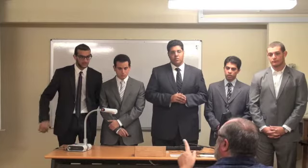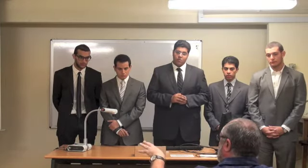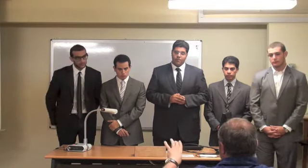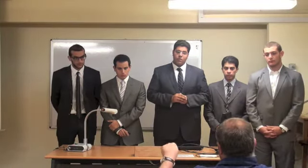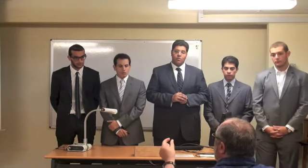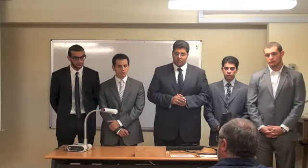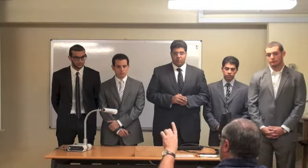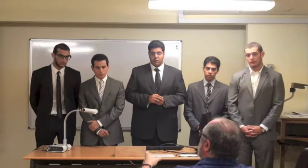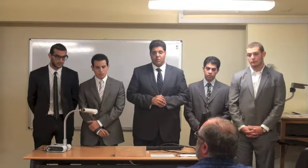Okay. Very good topic also, if you would like to think of applying some sort of cyclic loading to see the effect of fatigue, when the load value is changing, this might have an effect on the epoxy. So it is also a very interesting topic. You can use the same beam, you can apply cyclic loading, service loading, and then after that you can crush the beam up to failure. So you're doing two tests for the same specimen.